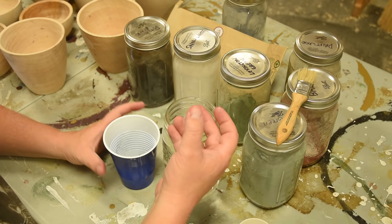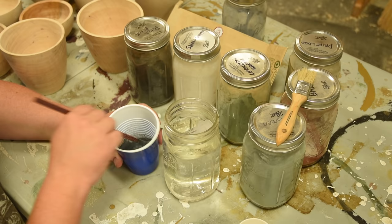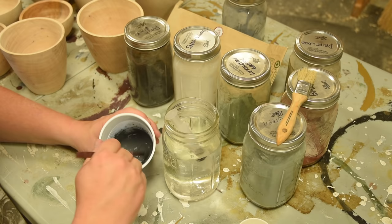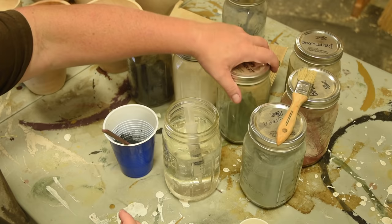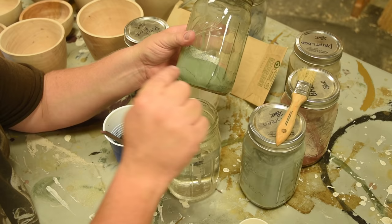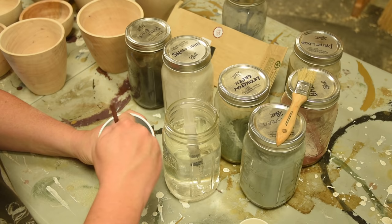Because milk paint requires two coats, I put a base coat of a very dark color — standard black — first. The top coat, because this isn't translucent, will be whatever color you put on it. But anytime it's scrubbed or worn, the black will come through before the wood. Because milk paint mixes with water, the color you see when you mix it is the color you'll get — it doesn't change as it dries. So if you mix two powders together before putting it on the wood, you'll get an actual representation of the final color. Mix it up, let it sit for a minute or two, and then apply it.